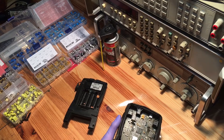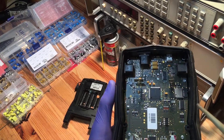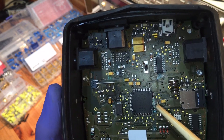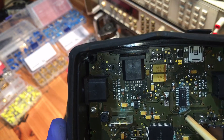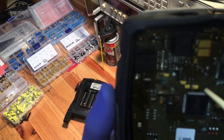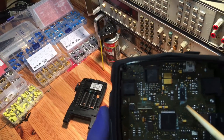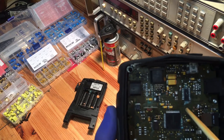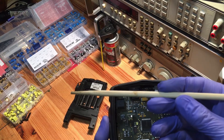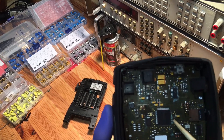It would not start up after I replaced brand new batteries because I thought they were just dead batteries. But if you look right here, you can see that beautiful green corrosion right on this chip, and nice green corrosion there caused by the battery acid. And I think we got some more going on right back here — a little corrosion. Corrosion acid is a conductive material, and it's the exact same thing as if you took a 12-volt car battery and dropped a wrench between the positive and negative and shorted it out. That is what corrosion does to IC chips.